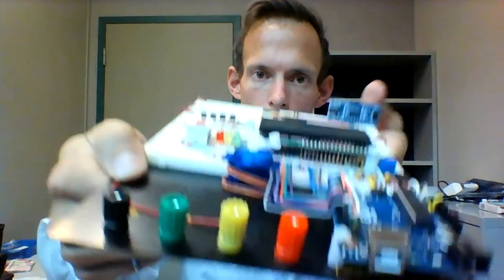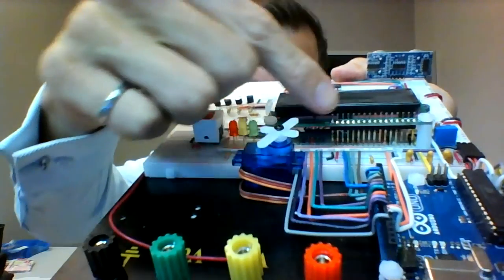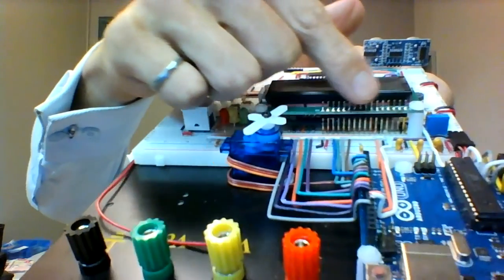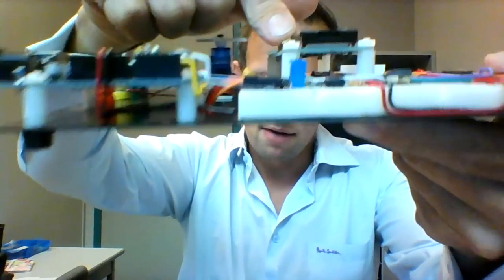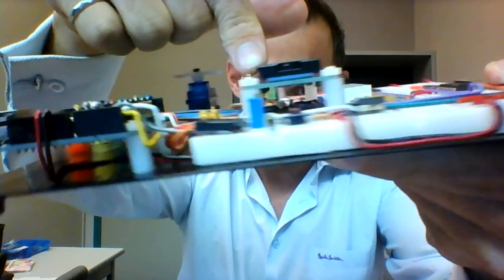You can use longer pins, like the ones in my hand. This is your preferred option because it allows you to add wiring underneath the LCD screen. If you look at my board here, you can see I've used the long pins and I've soldered them to the top. This allows me to have room underneath my LCD board to have wiring and other components.